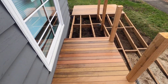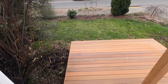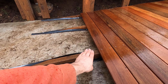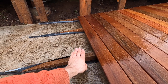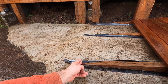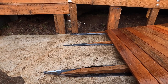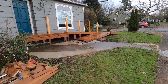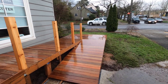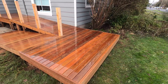I've gotten quite a bit done. I got a little bit sick of doing these short pieces so I went onto this deck, hung it off the end, and then skill-sawed the ends off because it's a tiny bit shorter than my decking. Down here where the transition is, I put half-inch treated plywood which runs just below the decking, and then eighth-inch aluminum sheet. The half-inch ply goes to 18 inches, and my sheet is usually 24. That works out perfect and comes up nice and flush. All of this stuff is going to get concrete-anchored in, so it'll sit down really nice and won't move. We're ending the day with a little bit of rain — I got this whole thing decked. I've only got a couple screws in each board just to keep them straight, so I'll spend quite a few hours coming around screwing everything. I did get into a little bit of the fascia.